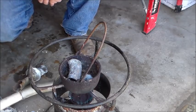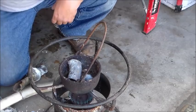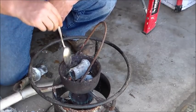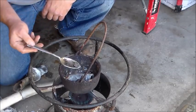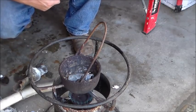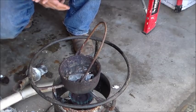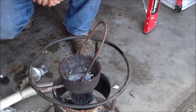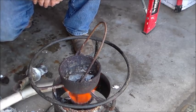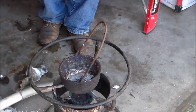It takes a little bit to melt this down. Once you get it started and the lead is really hot, you can pretty much feed pieces in one after the other. I'm starting to melt up here on the side — all of this is melted at the bottom, it's just working its way towards the top. You're going to get scum out of here — that's a no brainer. You just get rid of it, dump it off to the side. You might lose a little bit of lead in the process, but it is what it is. It's free lead, free bullet molds, free weights for fishing, spinner baits — whatever you want to use it for. This is fairly easy to do. As you notice I'm not wearing safety glasses — I don't really trip on that too much. I know what this stuff will do. I know to keep the water away from it. I'll probably put some on when I get to scooping.